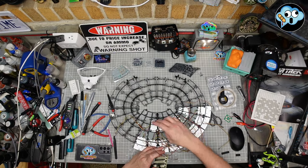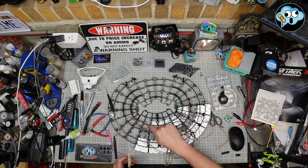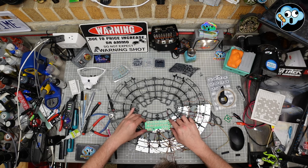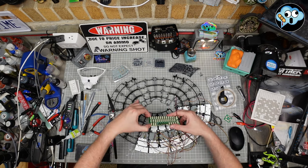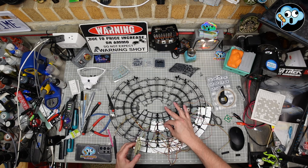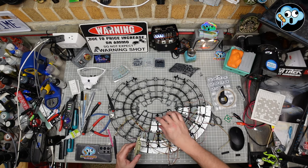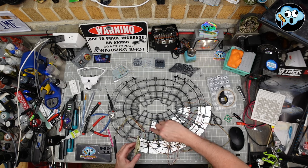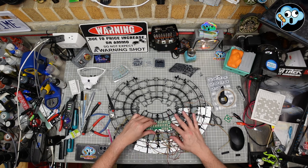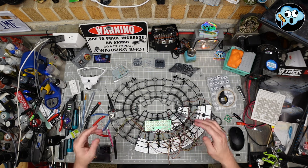Then we got to pull our wires out of the way here. Okay, get these all off to the side. There's four bosses here. 1, 2, 3, 4. We got to lay our circuit board down on those, and it should sit flush without any real resistance. And I'm getting a little resistance from these wires here. So what I think I'm going to do is lay these down a little over here so they're a little flatter. I'm going to push this one back, and I'm going to push this one forward so we have as little wire going over that rib right there as possible. So just wire, no heat shrink. And see, now she lays down without any tension needed to push it down.